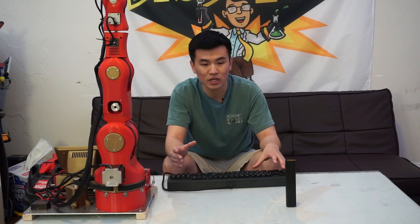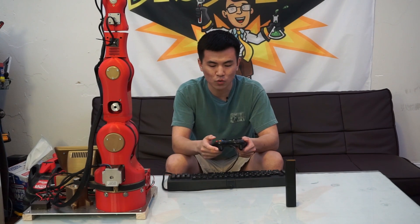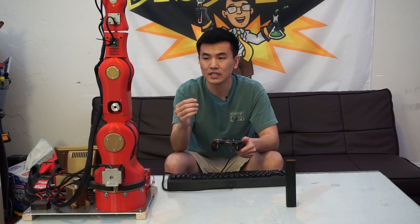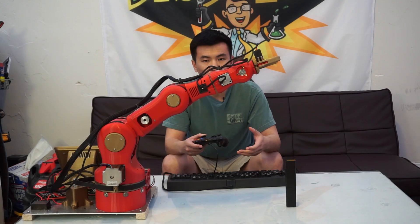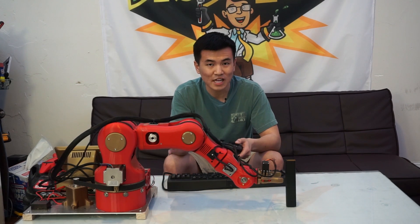Hey guys, it's Jeff. We're going to be programming the robotic arm to pick up this remote and then bring it back up. We have the keyboard set up so that when we save a point, we can give it a name to use later on. To get started, we need our Xbox controller. The first thing we need to do is set a home position for the robot — press start and that position is now the home position. Then we move the robotic arm into the place we want it to be, right in front of the remote so it can pick it up. It's moving slowly right now, but when we save it to the program it's going to run a lot faster — this basically just means we can't accidentally break anything while programming. The robotic arm is now in position to pick up the remote.